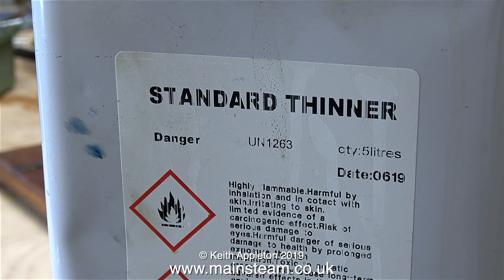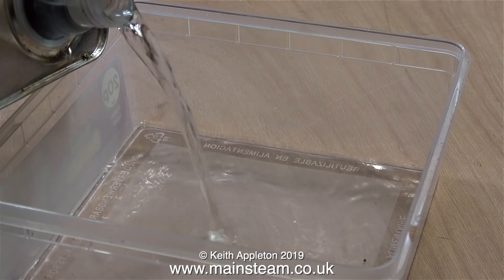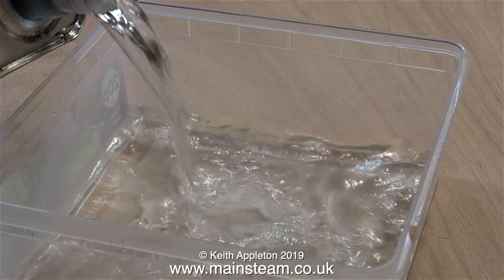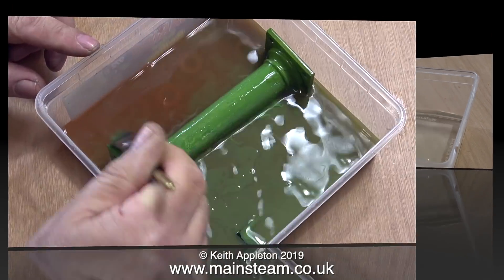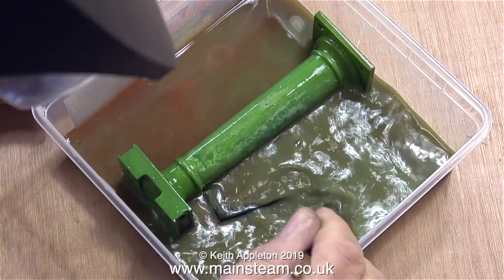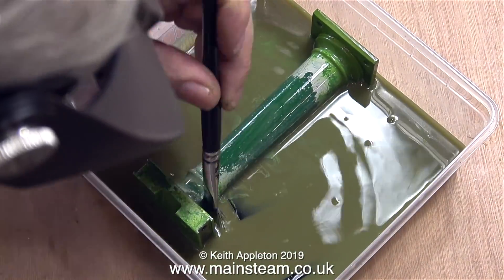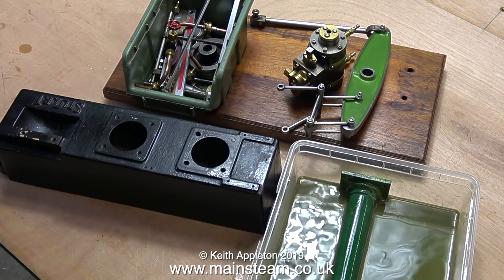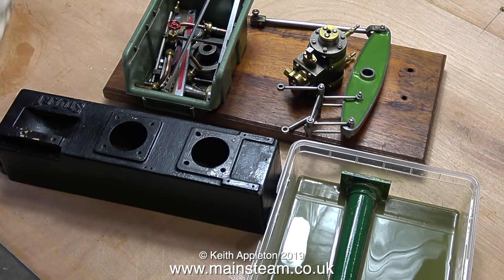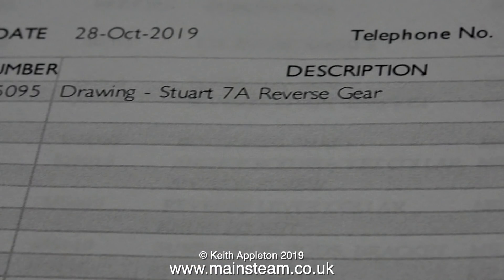The engine is now in pieces. This is a tin of standard cellulose thinners - when using this stuff it's probably a good idea to read the instructions, they're fairly scary. I'd just like to mention that in the new workshop I am in a very well ventilated area. I'm pouring a generous amount of cellulose thinners - also known as lacquer thinner in the USA - into a polythene tub, then adding all the painted parts and agitating with a paintbrush. The paint is starting to dissolve already. I'm going to leave the cellulose thinners to do its work and come back tomorrow after a walk down the garden, which currently still resembles the battle of the Somme.